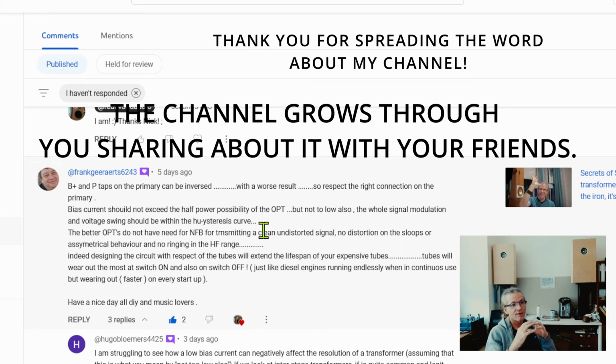The smaller one will have better resolution, better detail level, better clarity, but it won't have as relaxed a sound. It will sound more high strung. And when you have a bigger iron, it will sound more relaxed, more powerful, like your amp is not stressed out, but it won't sound as detailed. That's because the bigger capacitances and higher inductances will remove some finer parts of the signal, but it will have the capacity to have a big lung. So smaller iron, smaller lung, but more articulation; bigger iron, bigger lung, but not as articulated.